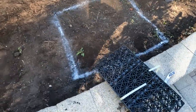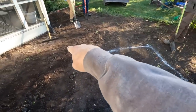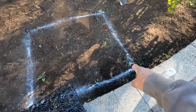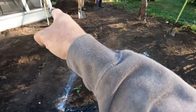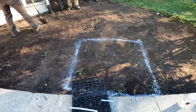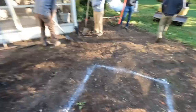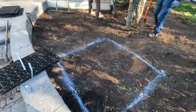There's the location for our six small Aqua Blocks. The waterfall is going to start over there, dropping and twisting hard this way, then the waterfall comes in somewhere down here. The pump vault will be located on one of these corners depending on elevations. We're also going to dig in a first flush drain over there, run drain tile snaking it this way, dumping it high off the liner — acting as a natural autofill. We'll drop the top of the reservoir eight to ten inches below existing grade to get the pitch for that gravity-fed first flush.